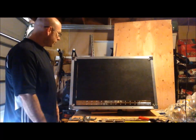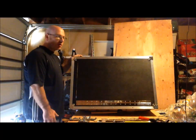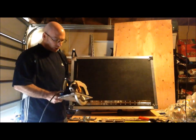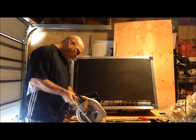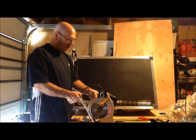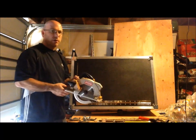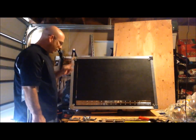So what I'm going to do next is describe how I made these cuts. These cuts were done with a circular table saw, with the ability to drop the blade onto your product. Like this, with this up, it does not touch the product, and you slowly bring it down onto the product, creating your slot, creating your first cut, then sliding it down, then sliding it down.